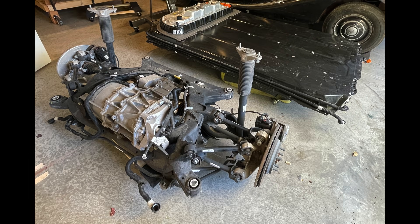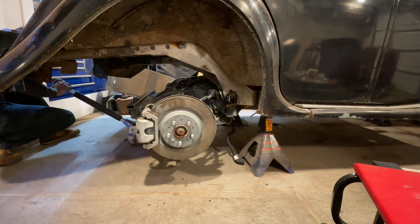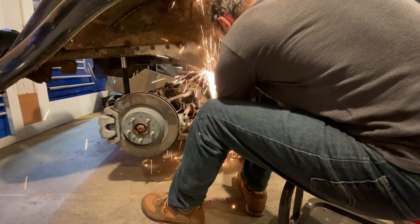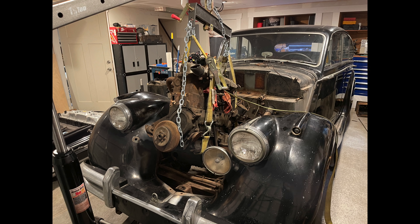It's definitely a good idea in my case, as I would love to upgrade the suspension and brakes on this car as well as the motor. In fact, in the future, I suspect you're going to see a lot more subframe swaps than just motor swaps, especially with old vehicles. In any case, the process is basically the same: you take the new motor or subframe and you put it roughly where it will go in the old car, cut away the parts that interfere, and weld up some mounts. It was a little more complicated than that in this case for a couple of reasons.